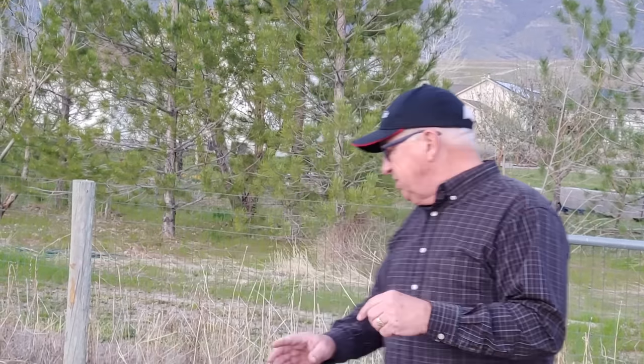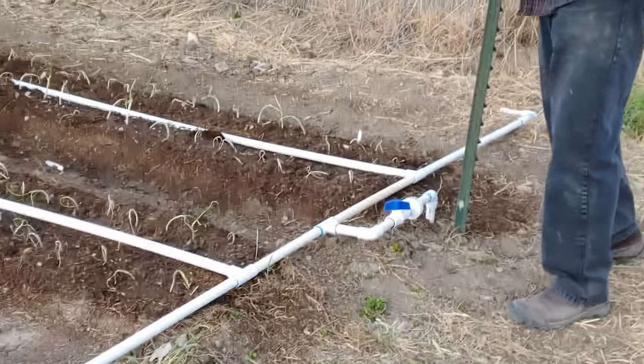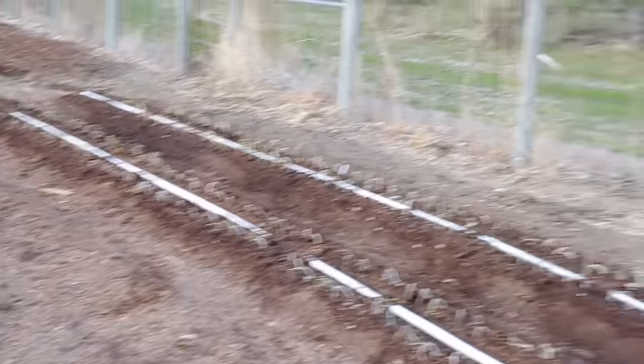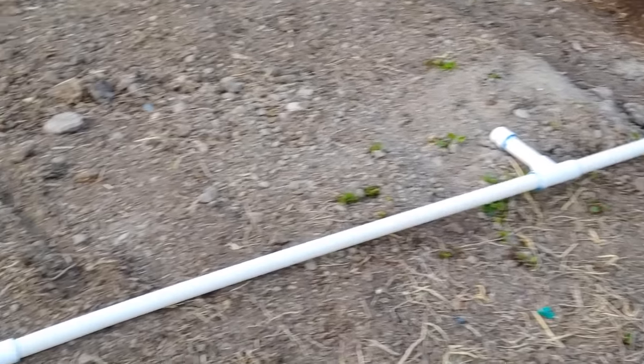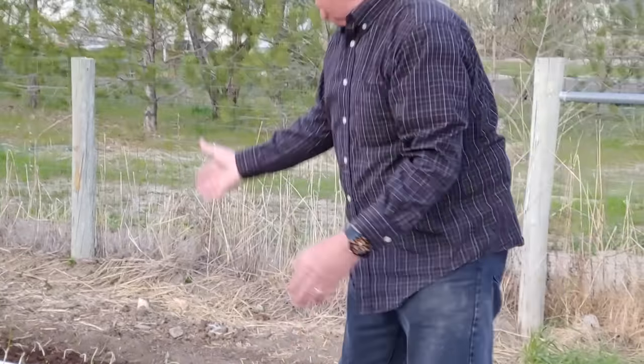Let's go ahead and look at what it takes to build one of these surface-mounted systems. I'll get into detail shots in a few moments, but let's give you an overview. As you can see, this system is surface mounted — it just lays on top of the furrow rows or the hills. I create a basic manifold that is a straight line with a set of T's, except out on the end there's elbows. I space these three feet apart, which is a great general-purpose distance, even with corn.